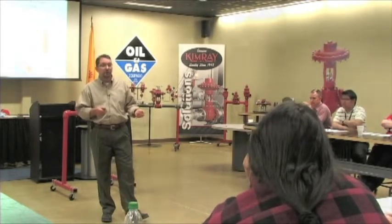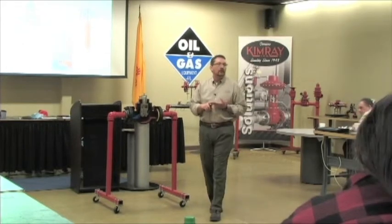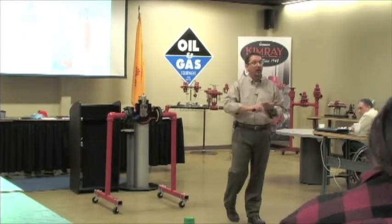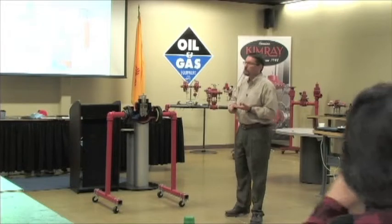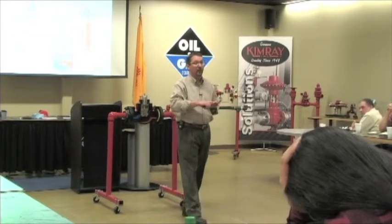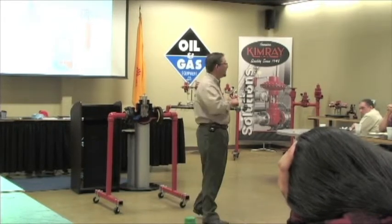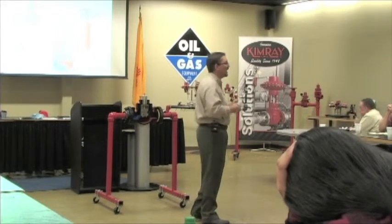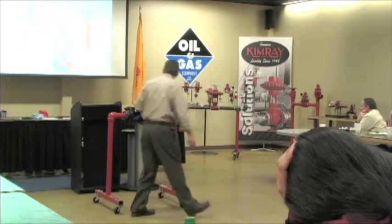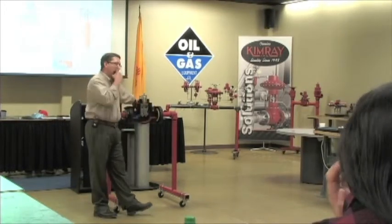...intuitively that would mean back pressure. For 402 FGT PR: '4' is for 4-inch, '02' times 10 is 20 — a 20-pound spring. FGT versus SGT: 'F' stands for flange, 'G' for gas — it's a G-series, meaning it's a regulator, versus an 'M.' If it says FMT, it's flange and it's a motor valve.